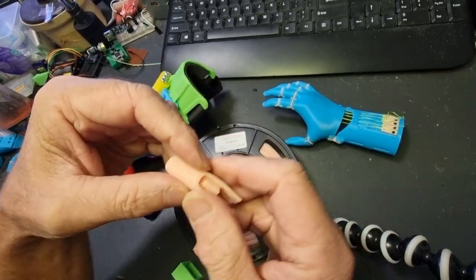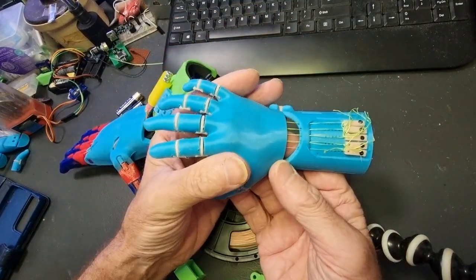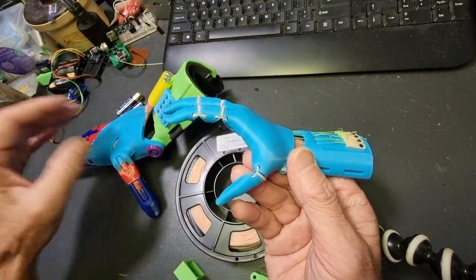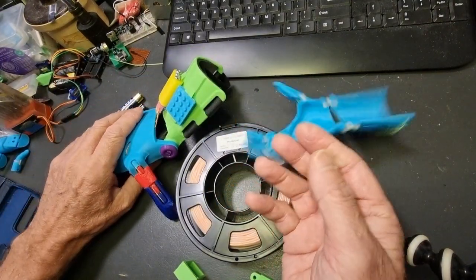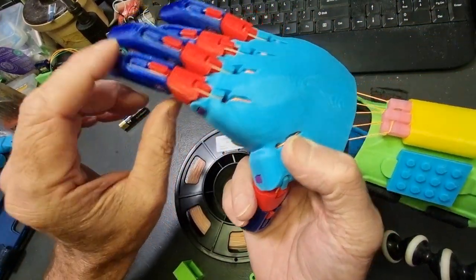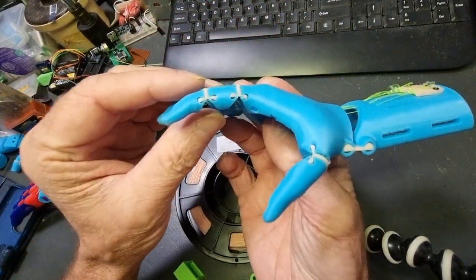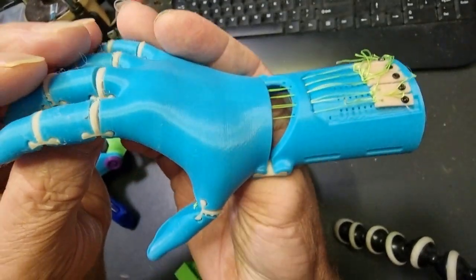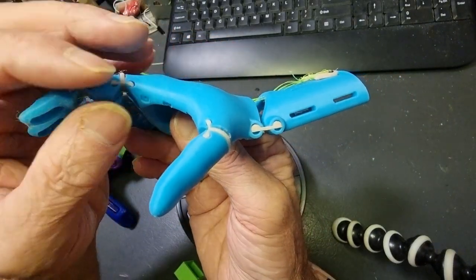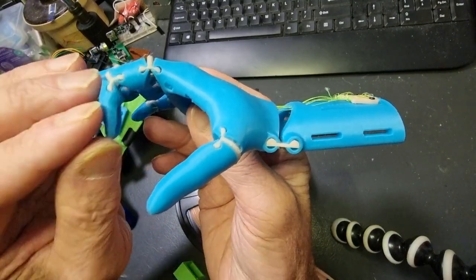To find a practical use for it, a person on the Enable website — Xavier — put me onto the design of this hand. So what we do here is instead of having pins that hold the hand together in the original style — where pins go in and you have dental elastic on the back — this idea uses a fully 3D printed hinge. It prints with a little pin either side and a flat cartilage in the middle, and that replaces both the pins and the rubber bands.